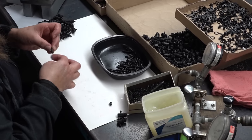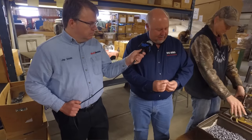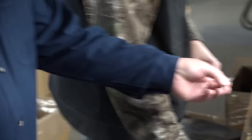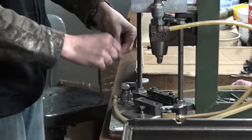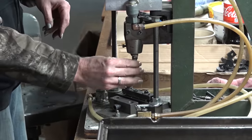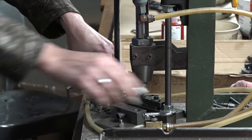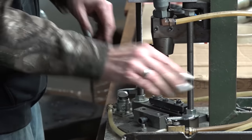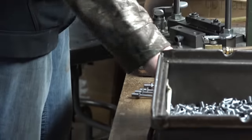We've got a bucket of parts here. Can you tell us what's going on here? These are our axle shafts. This is a screw machine part, and then what we do is take and cut music wire to a certain length, and then around this press right here, Kelly will show you — we'll press the actual screw machine part into the axle shaft. That's the strongest way you can do it. If this were all screw machined out of one piece, it wouldn't be hardened as much, and you'd have a really weak point. By pressing the two together, we create the strongest axle shaft that you can make.